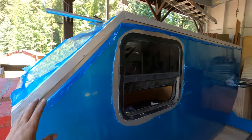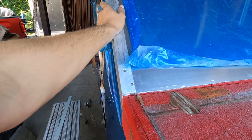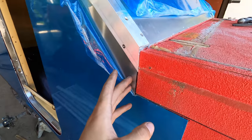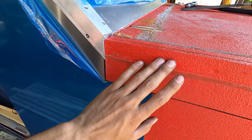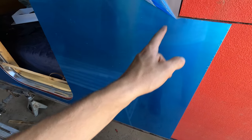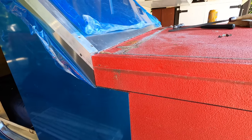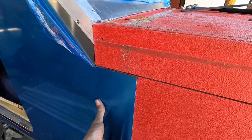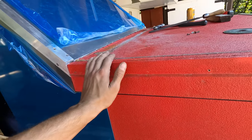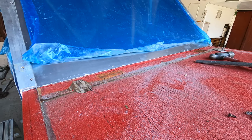I've got all the flat finish aluminum up — the roof, the sides, and the trim. There's a lot of this stuff I've just been doing without the camera, but so far I'm really happy with how it's coming. The checker plate is going to start here and run that way — all smooth — then run on an angle to 48 inches, measure my two points, and cut it off on an angle, doing that for both sides. That way I've got quite the overlap for a seam so the water doesn't get in. We're going to work on the hinge first because it seems the easier one to do. Stay tuned for the next part. Thanks for watching — see you in the next one.